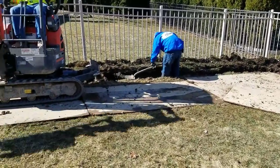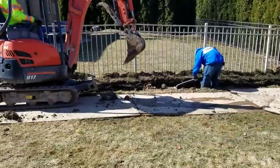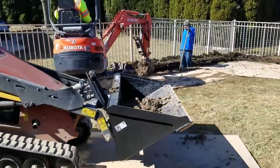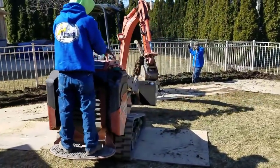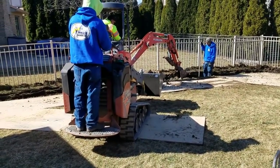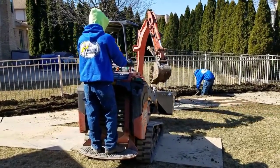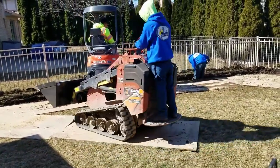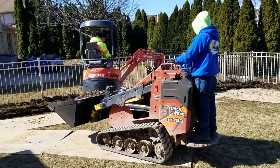One of the biggest problems out there is guys are not equipped to haul the dirt away, so they're trying to put dirt over top of the drain system — and now it doesn't grab surface water. They'll put inlet basins in line with their system to improve it. But it won't work nearly as well as a French drain full of stone with just two and a half inches of turf and grass root over top — that'll take water in for the entire length of the drain.